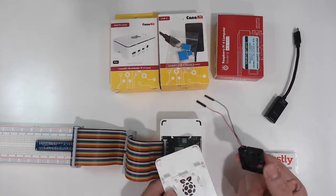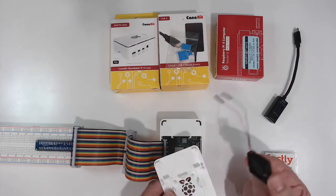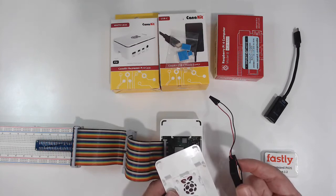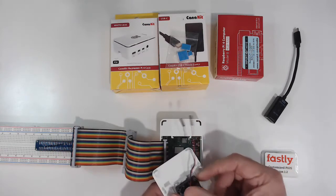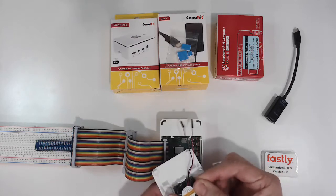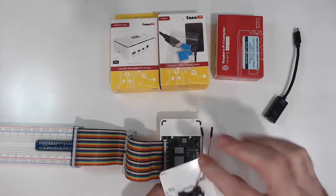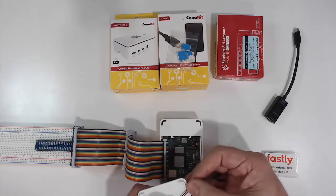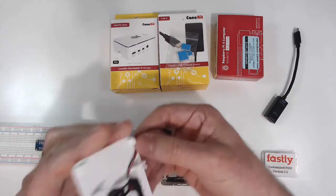Now, technically, negative case pressure is what people work toward. The idea is that it's more efficient, more effective, but you really need a very powerful fan to make a difference. So my preference is to push the fan in with the label facing up, because that gives more protection for the fan blades and keeps them from getting caught up in any wires. You can hold the wires in between the couple of spots that click into the case.